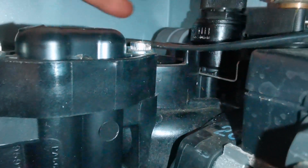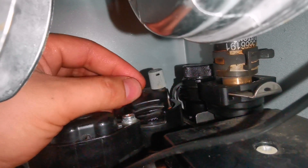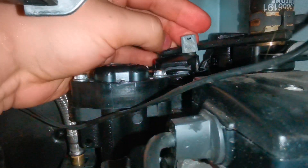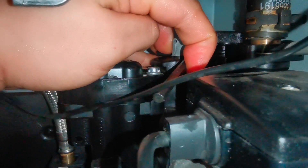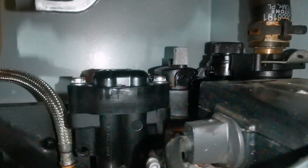Always try to pull the PRV out to test that it's in there, because if there's pressure against it it might push out when you fill up with water. Now the AAV has a little lug that sticks out — you push it in and then twist. A good trick is to use an Allen key: simply place a finger in the middle and use your index finger to twist it around. It keeps it level. If you try to do this with your hands in awkward boilers it just doesn't happen and can be quite frustrating. On this Vitodens it isn't too bad, but it's still a good trick to know.